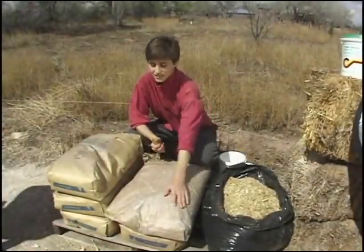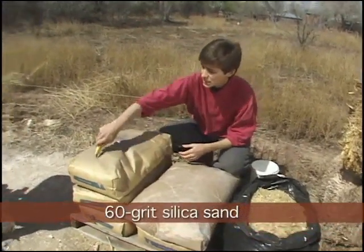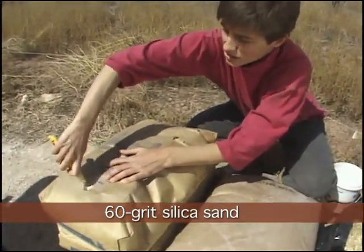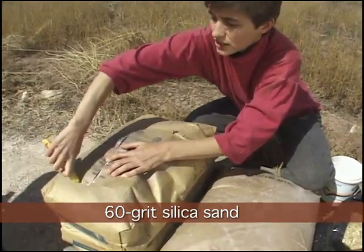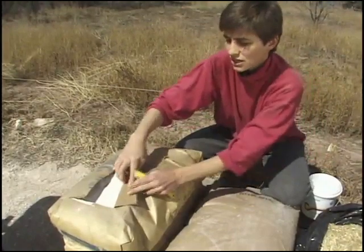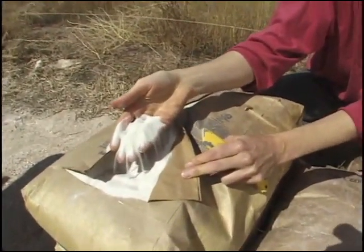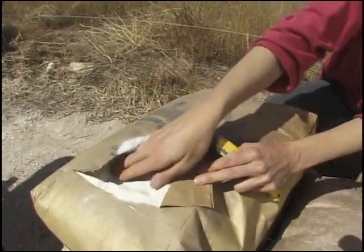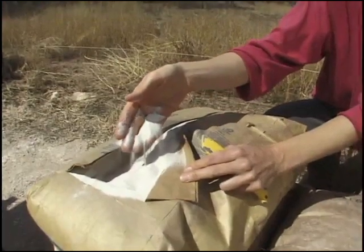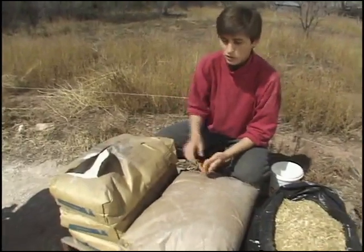We're ready to start talking about the materials. Here we've got 60 grit silica sand — white silica sand. You can use a 70, a 90, or even a 30. If color is important to you and you want a really good clean color, make sure you have a really good white sand. Sometimes it's hard to find this. You can also window-screen regular mortar sand and that will work perfectly well, though you won't get as fine a polish on your finished plasters.